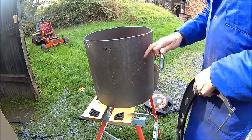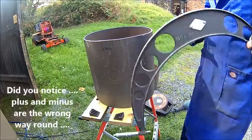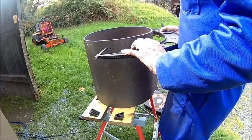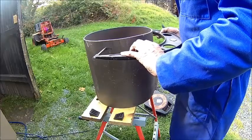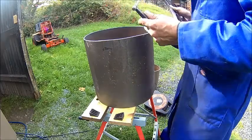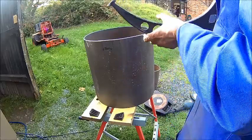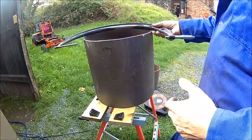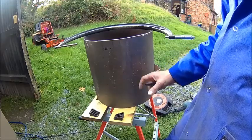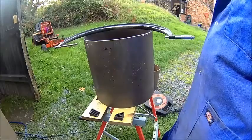I checked that before — it's that end which is a bit compressed. Nothing much to do about it, it's about a millimeter. What we're going to do is use a bottle jack and just expand it a little bit until it's round. That's the reason why I bought this big micrometer, because I didn't have one. Not too concerning — I checked a few other spots and I can't see any big dents. It's very consistent: this side is plus and this side is minus. So we expand it here or compress it on the press.